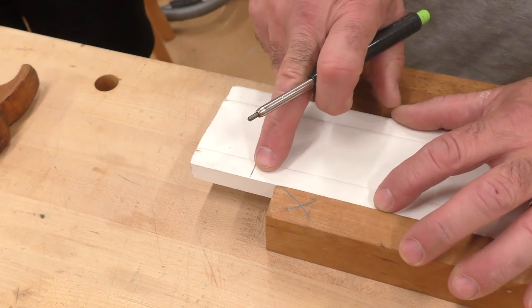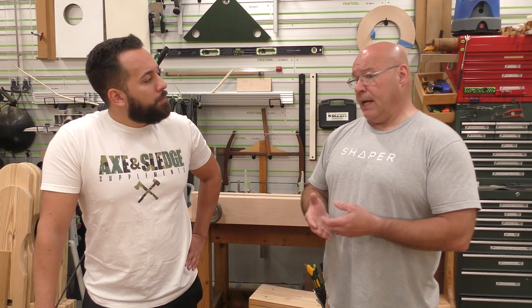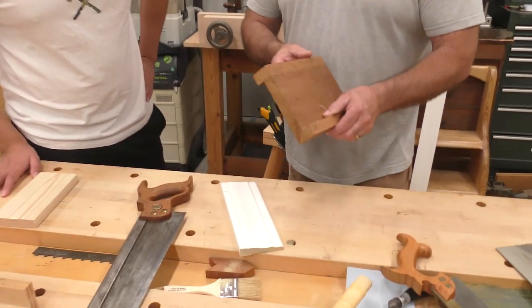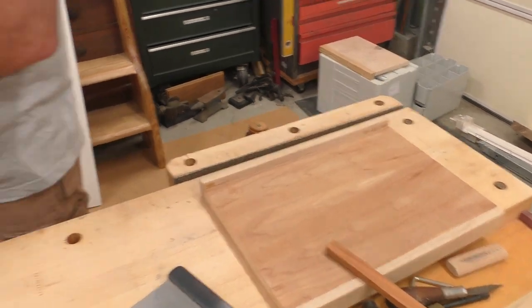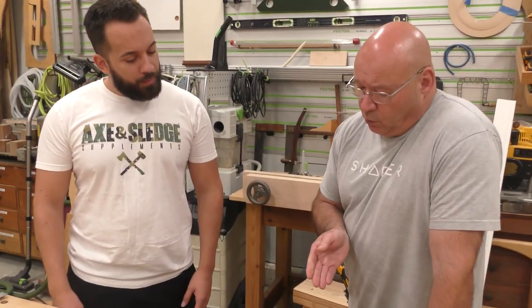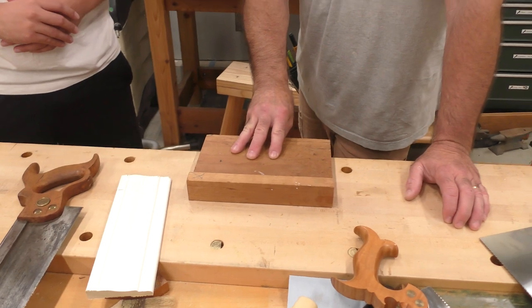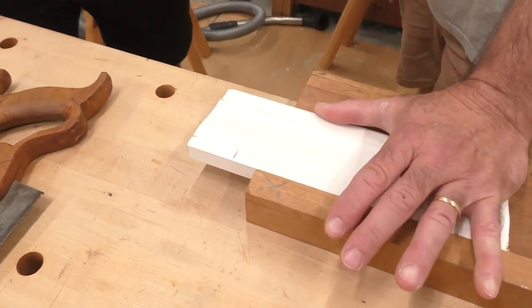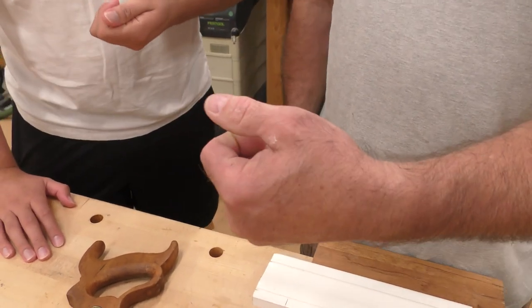I always take it right here — that's your tick mark. When we get into fine joinery I'll show you how to use a knife mark and do a perfect 90-degree cross cut. But today I've got these bench hooks in different sizes — we'll make what's known as a bench hook. I can use this whether I'm using a western cut or an eastern cut. Watch how it goes against the bench like this, with my hands right here.